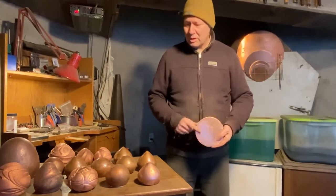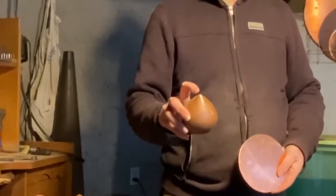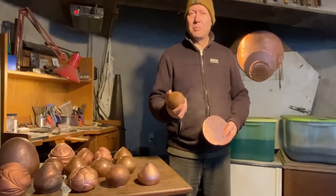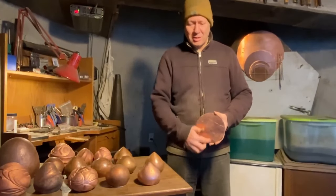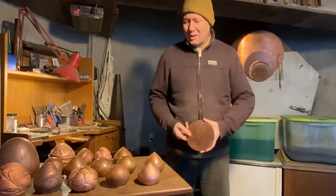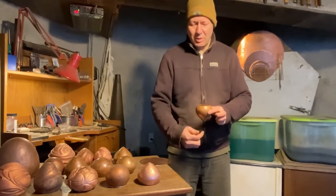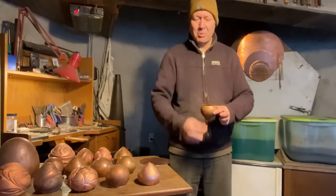Okay, but the goal is we're going to try and transform this one into something more like this that has a pointed end on it. So you can see the various processes involved in that. If you start with a 6-inch disc, 6-inch diameter, it will tend to give you a piece that ends up being, if you add the height plus the width, about 6 inches. So this is probably 3 by 3,